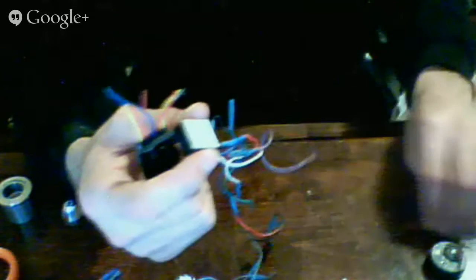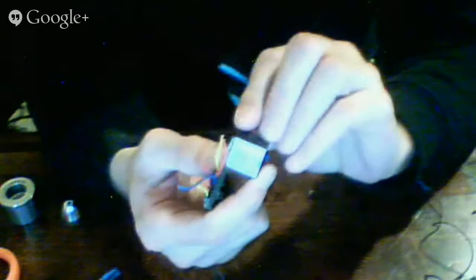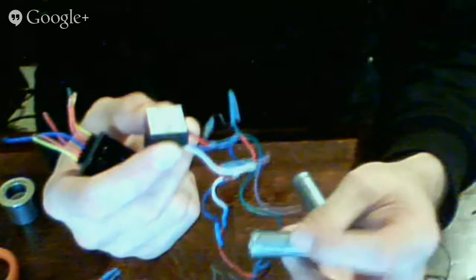If you don't have an LED driver, you're going to need one. One option is a board that has the LED driver built in — the Igniter is such a board. What I've opted for is a buck puck. When you plug in two 3.7-volt batteries in series you get a 7.4-volt system. Running 7.4 volts directly to an LED is enough to knock it to the moon — you will burn it right out. So you have to get some type of resistor or a buck puck as your LED driver to regulate the current.